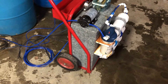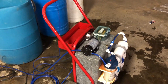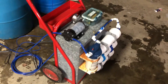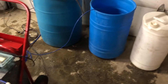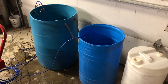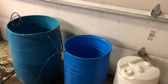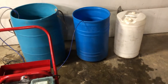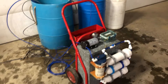Not a bad looking little project for some scrap metal that came out of a few different dumpsters. Just to further explain what we've got going on here — this is a batch system, so I'll be running the RO water here to the right and the concentrate back into the left. I'm expecting this is going to take about four hours roughly to get us to 8.5 percent sugar content. That's going to be about three passes through the system.